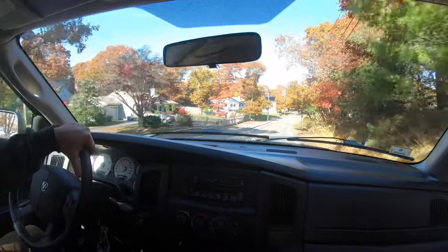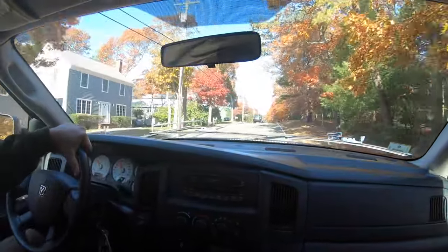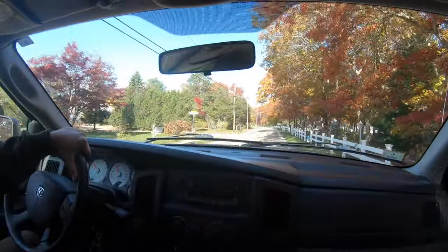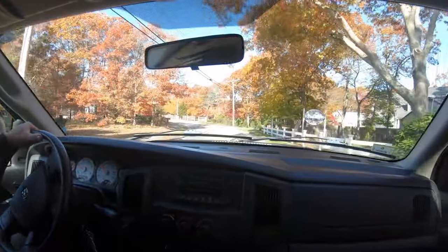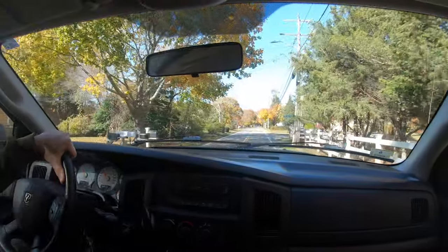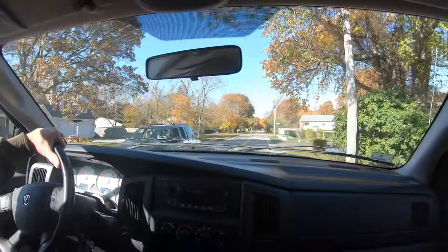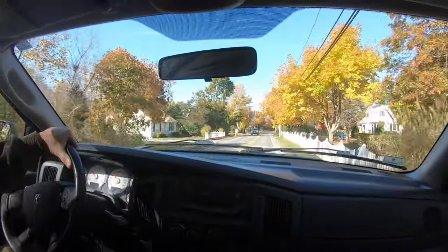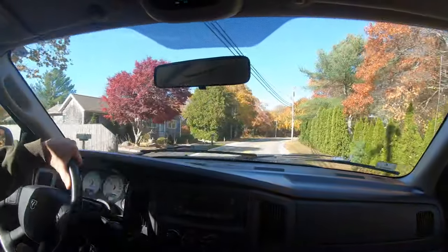However, it just couldn't handle a large volume efficiently enough to make it worth the purchase and setup. If you're going to take the plunge, I'd suggest at least a 16. They're pretty much all 18 horsepower now, the same physical motor size as the 16, just getting two more horsepower out of the same engine. It's still turning at the same RPM — all it does is allow you to run a bigger impeller, which moves more volume of air.